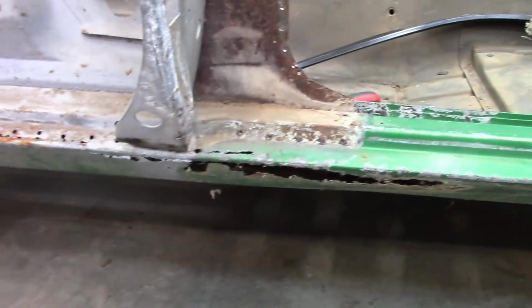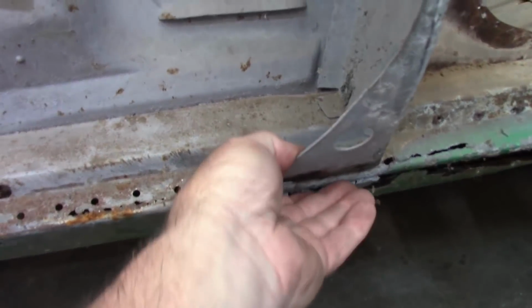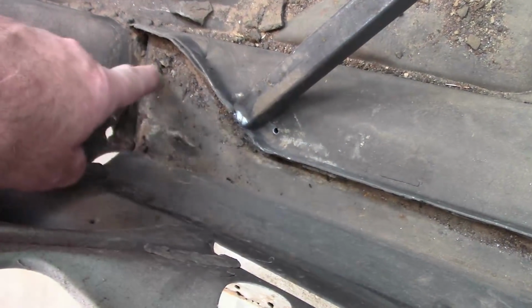Now back here, I have to deal with all the sheet metal again, and we'll say the B pillar. So that attaches, pretty simple. It's got a little spot weld on that. This, I think they've already cut it loose here. If you looked at the other video, you know that there's an interaction between the inner and outer that gets a little complicated back here. You've got the corner and this inner piece, it stays. So I have to get this apart, and coming forward, of course, all the spot welds.